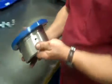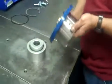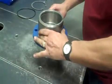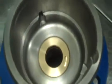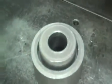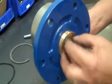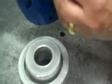Then we take it over to our fixture here and flip it upside down. The reason we use this particular type of fixture is you don't want to try to push that shaft through without it having some kind of support. We have a small enough hole that this is where it's going to rest.